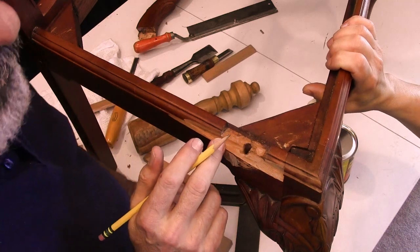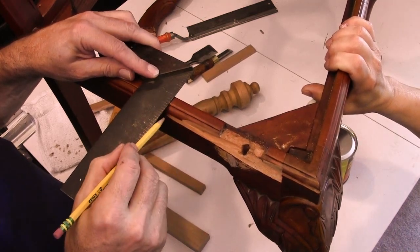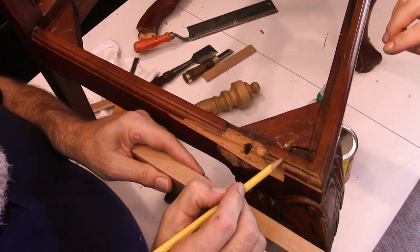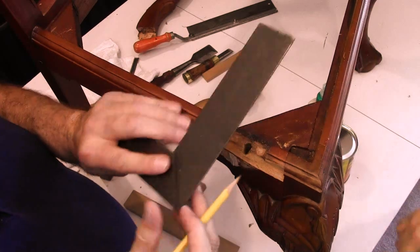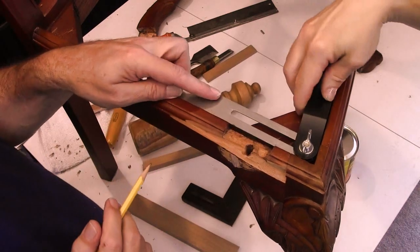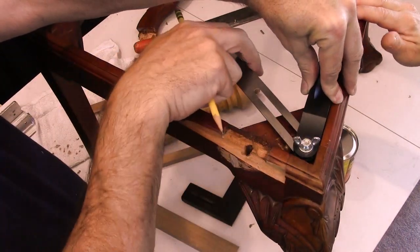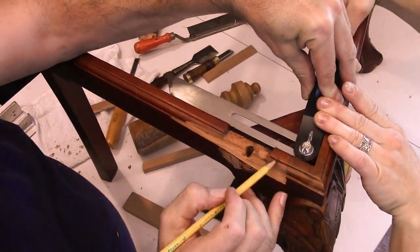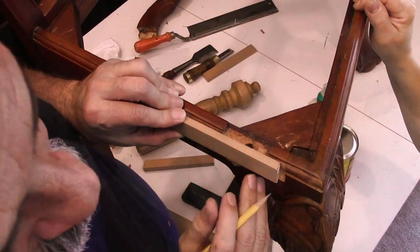What we're going to do is carve out some of this so we can put a square piece of wood in there, and then shape that square piece to match this molding using those planes. We've got this wedge shape and we bought some wood to replace it with, but we have a little problem: we use the square to mark where we're going to cut this wood away, and the new wood is square on one end but we have to transfer this angle because this end is not square. So what we have to use is a bevel. You just loosen the screw and change the angle, then slide it right over — tighten that and we'll have this angle already set. When we put this piece in it'll slide in and replace that without a problem.